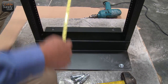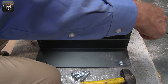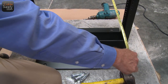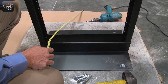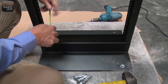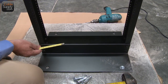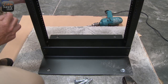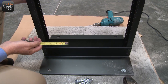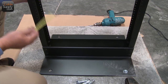You're going to want to take your tape measure and measure from that wall to make sure this distance here is going to be the same on the other side — so you want to get that square to the wall. Now's the time to do it. Once your first anchor is in, get it square to the wall, make sure it's proper, make sure it's square, make sure it looks good. You don't want a crooked data rack — it's going to show and it's going to cause difficulty when you put in your cable ladders.